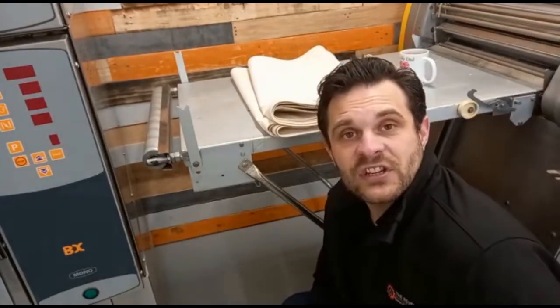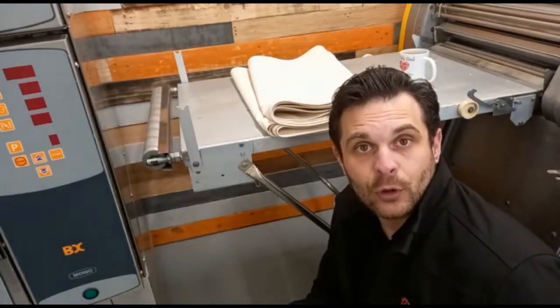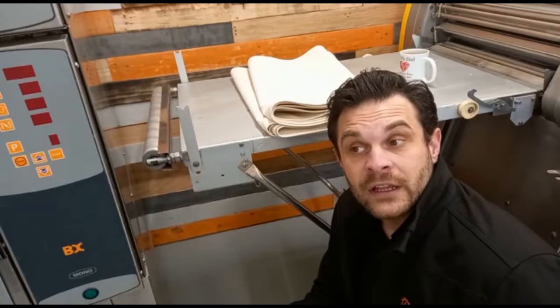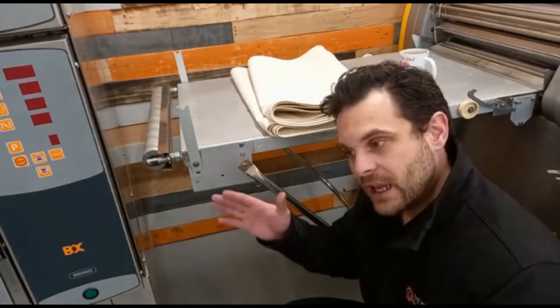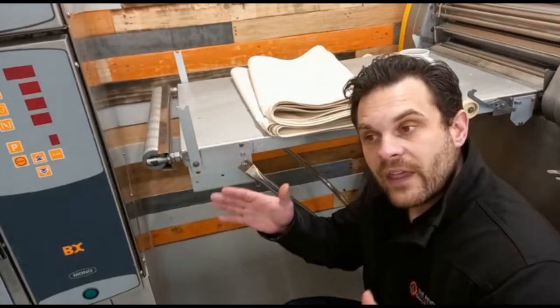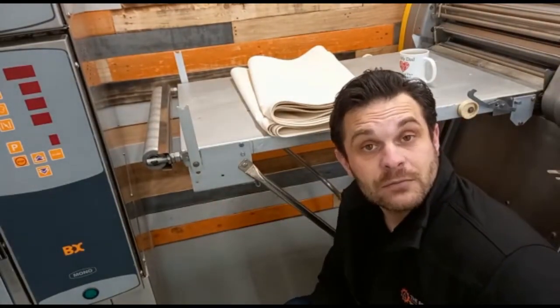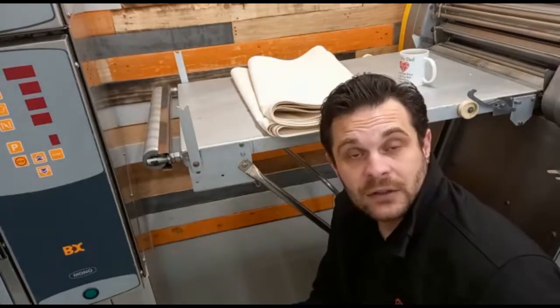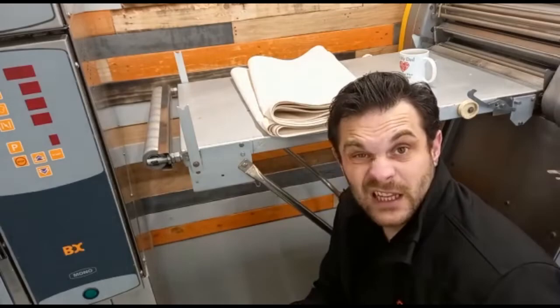If you're purchasing canvas belts, canvas belts will be slightly wider than your idle roller when manufactured. The reason for this is because as the tension is applied to the belt, it will become narrower and therefore sit perfectly on the idle roller. The seams will actually help track the belt and keep it running nice and true, and this will also extend the life of the belt.